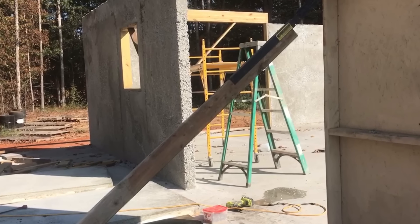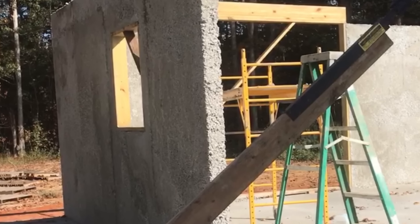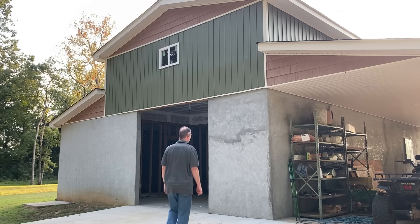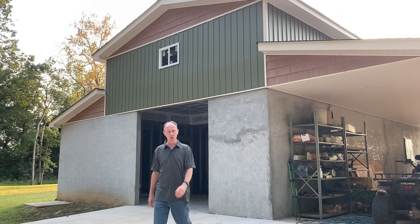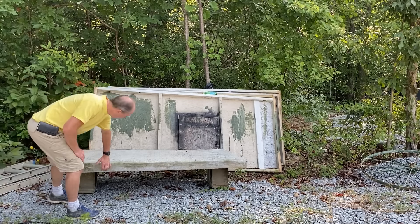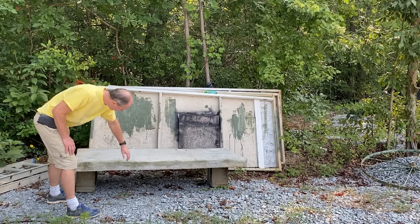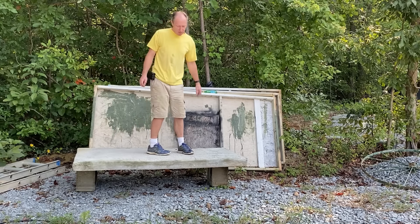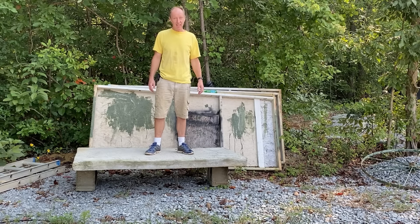The wall is very lightweight and flimsy right after pouring — you can push it over no problem at that point. You've got to get it covered with the fiber mesh and the stucco, and that is where you really get your strength. Here is a three-and-a-half-inch thick AirCrete and part AirCrete styrofoam. I covered it with roofing fabric and did a slurry coat stucco. There is no steel, no wood, nothing in this, and that shows how strong this thing is at three-and-a-half inches.